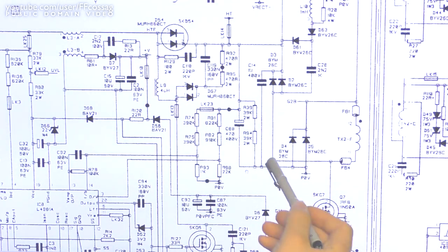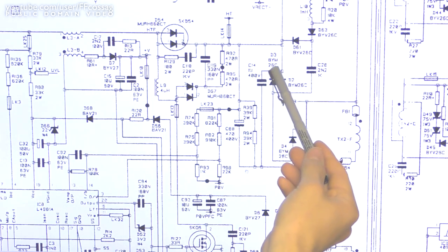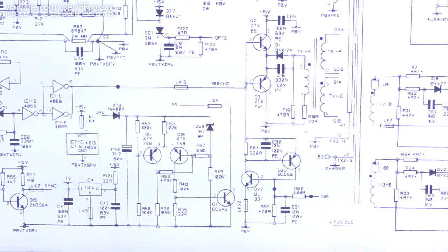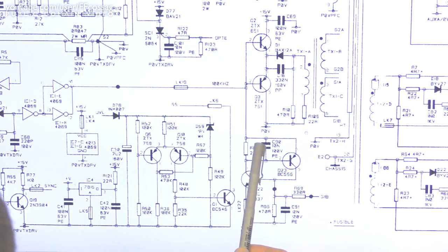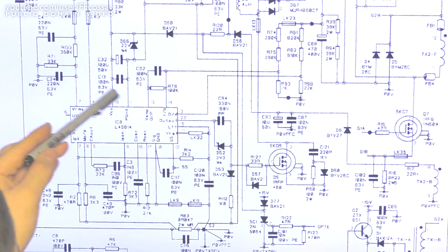again, the issue was we had a flashover from here, which is a roughly 400 volts, 380 volts supply, down to this point, which is just a random part in a circuit which is running off a stabilized 15 volt power supply. So it's not, I said this was the PFC circuit, it's not really. The PFC circuit is this thing here, powered by this giant IC, which you can't get anymore, so I really hope that's not fried, but I don't think it is, thankfully.